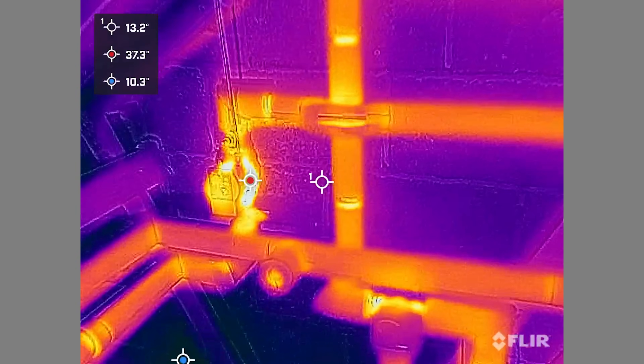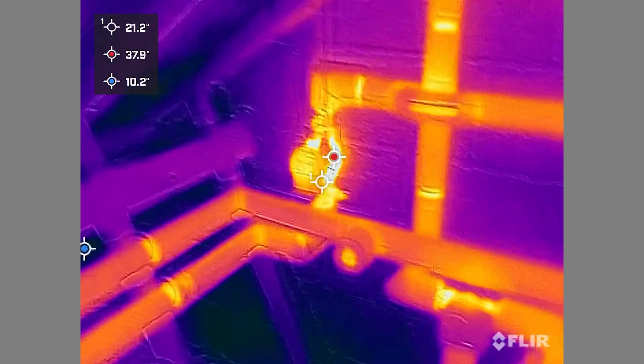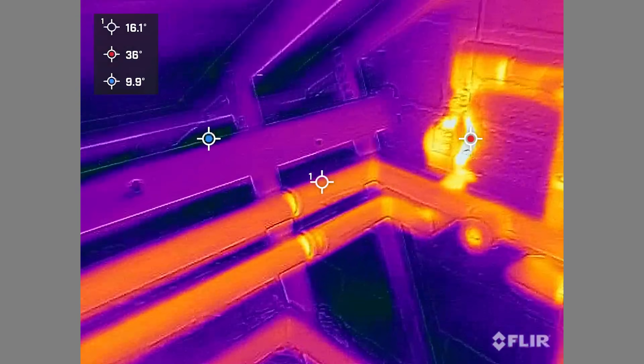You could wrap them in insulated foil yourself, or cut a little bit of foam and reshape it if you want to spend some DIY time. I decided to spend my DIY time insulating the largest uninsulated volume areas. The biggest area that glowed up really hot was around the pump - on mine I have a buffer tank with a separate pump circulating the system, and that pump glowed up very hot.